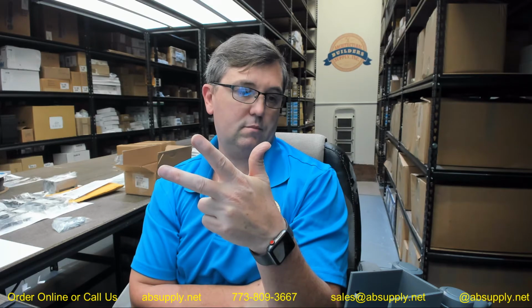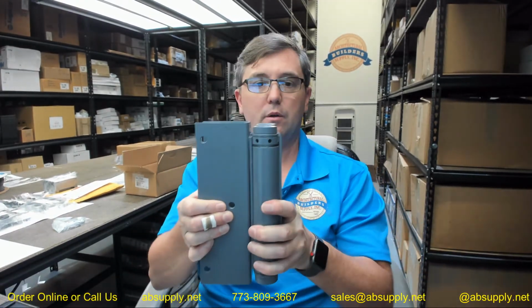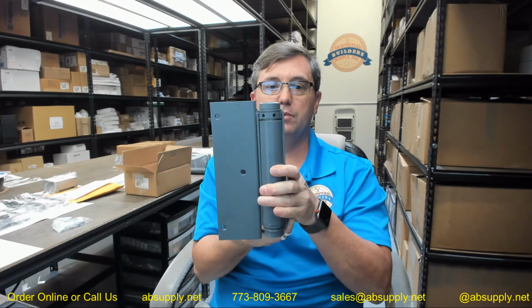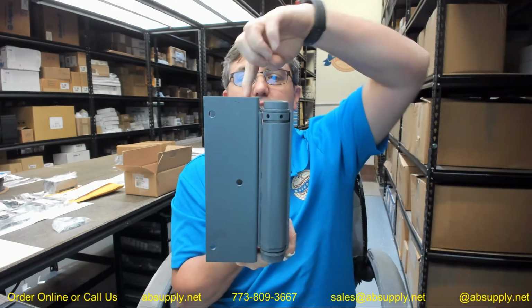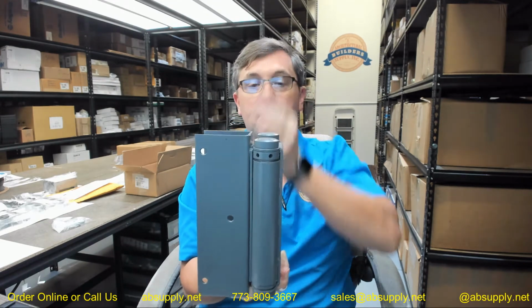That is all based on mortising your door 1 1/8 inches, which means the only way to make this work is to notch the door significantly. Here's what I'm saying. You're looking at this hinge in an elevation view installed. Your door is going to come to here, right? Well, that's no good because you've got almost 2 inches of exposed space over here that you're going to be able to see right through.